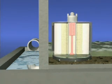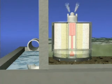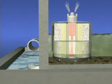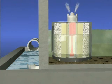The siphon draws polluted stormwater through the filtration media and into a center drainage tube. The siphon mechanism is activated as the vault fills with water and the trapped air is purged from under the filter cartridge hood through the air relief valve.